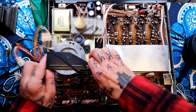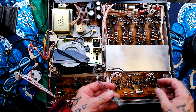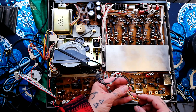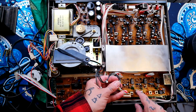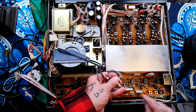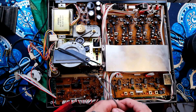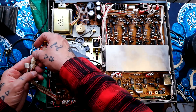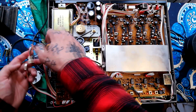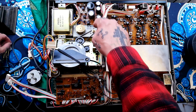The transport is removed now. The heads are identifiable by these thin grey cables plugging into sockets here. The sockets are similar to what you'd see on the 244, except the gender of these KK Molex headers and sockets is reversed — you would have the pin header on the board on the 244, whereas it's on the daughter board on these. The attachments for power and control signals for the motors and solenoids are attached with two Molex KK sockets here, a bit stiff but no problem.